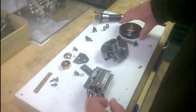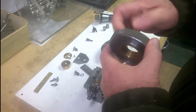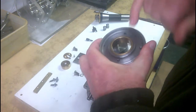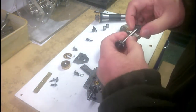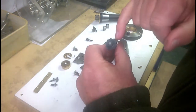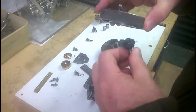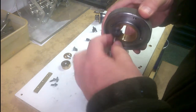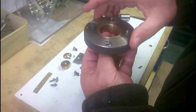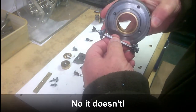The drive is taken from the feed ring, which fits over here. The drive pins screw into the feed ring and project into this trepanned area here. As it rotates, the pins move the rotor cogs which rotate as each pin comes around. So putting one pin in at that angle, at that position, hits this one. And if you put it in the outer hole — these are two different pitch circles — it doubles the amount of movement per rotation.